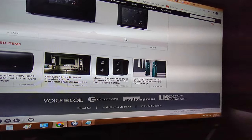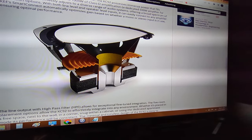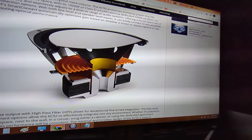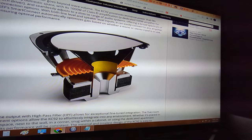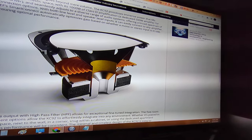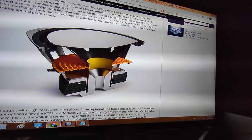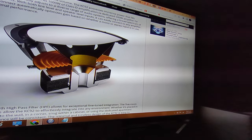You could actually make something like this yourself using Parts Express stuff and even car woofers. They have this venting here — it doesn't do what you think it does. The idea is that it allows heat to dissipate through these holes. The problem is that puts a lot of air pressure stress on the dust cap, which is a no-no. The better way is just to use a strong paper cone with an inner cap, isolating the heat generated by the voice coil out to the steel in the T-yoke and the top plate.